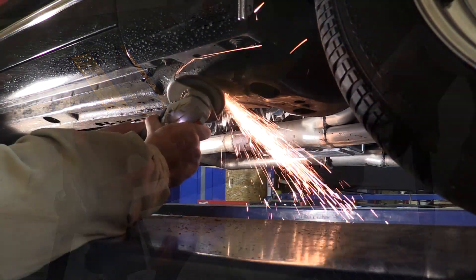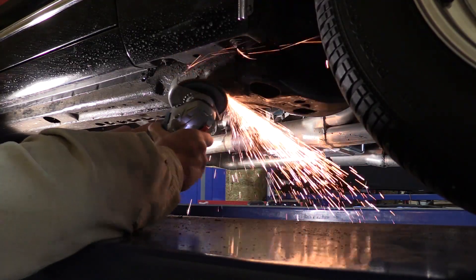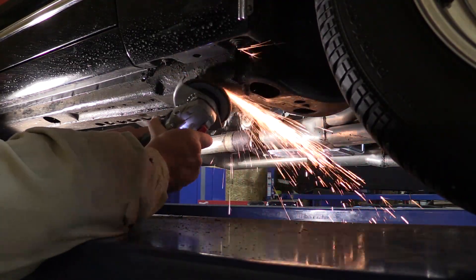But the bigger thing that we're seeing with a lot of these larger batteries is, as we draw more amps through them, heat buildup becomes an issue — and how is everyone dealing with that? Well, they're dealing with it in multiple different ways. Some of them are just ignoring it, and if you've watched some of our videos before, we'll see a lot of thermal timeouts in these larger tools.